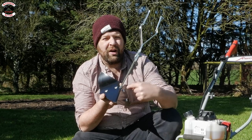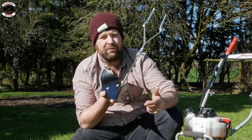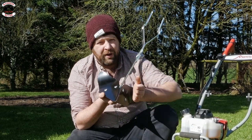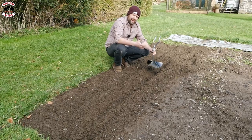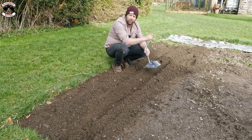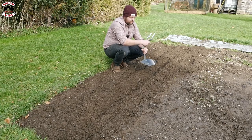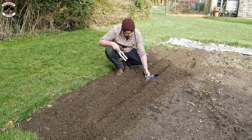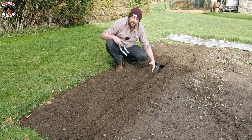Probably my favorite attachment is this little plow. If you're going to sow your potatoes — tatties, spudges, whatever you want to call them — put this on the back of your tiller. It will drive itself along and make a nice little tunnel or furrow all the way through; you can drop your seeds in, turn them back over, and it will be ready to grow. You actually bolt this one onto the Mantis — there are a couple of bolts on the frame. It can be quickly and easily removed, but this bit can stay on the machine. The principle behind it is that it's designed to go through the ground and push the soil to the side, giving you a nice trench for all your seeds.